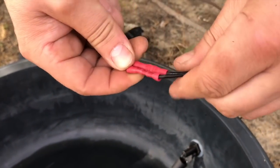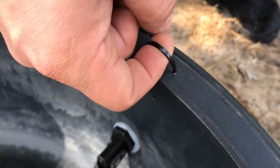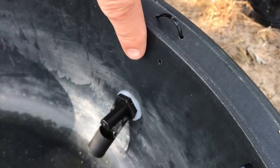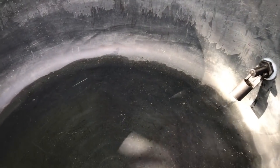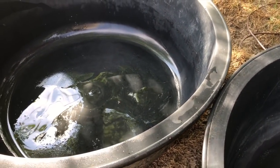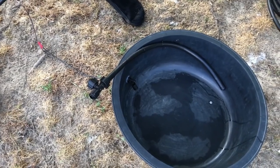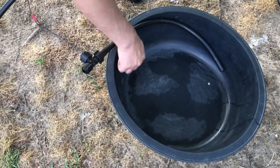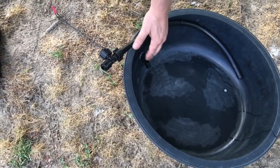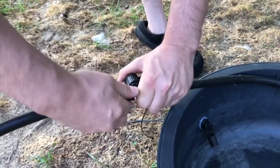We're going to wrap it with electrical tape and bury it. The bowl has pre-drilled holes and we've got twist ties to secure our poly tube. It's going to come in over the level switch — we don't want it to interfere — so we'll run it along the sides and down into the bowl. We're going to set up a second bowl on a tee so the dogs always have good water with redundancy when one bowl goes empty.